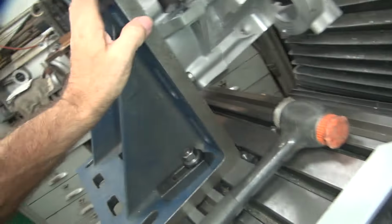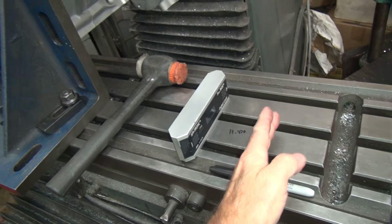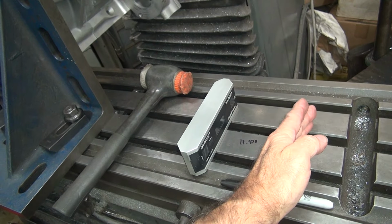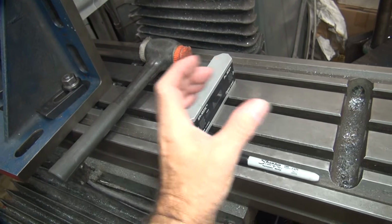The other problem is there's a tilt angle, so the cylinders are at a 45-degree angle, which means they're 22.5 degrees off the center. So if your motor is tilted forward or back, you'll have a plus or negative tilt to it in degrees. And Harley tends to move their motors forward a little bit to get more exhaust clearance to the back of the frame and head clearance.